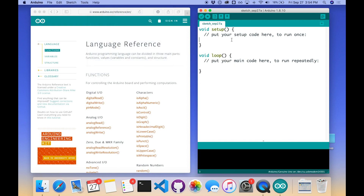Now I'm ready to write code. I'm going to use the LED that was blinking one second on and one second off by default. My first program will change that so it blinks faster — very rapidly — replacing the default program with my own custom program. I'll add some code to the setup function and some to the loop function, where the actual blinking will occur. For the first thing in setup, I need to tell the Arduino that pin 13 — which I know is connected to that little yellow LED — is what we'll configure.